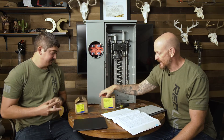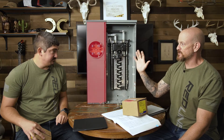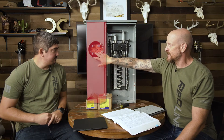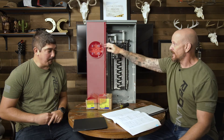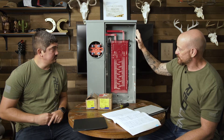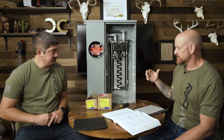This is like the most common electrical panel we install — it's a 200-amp all-in-one residential home line. Your utility comes in from this area. Once we install it, we're not really allowed to get in there afterwards. SRP or APS will put a lock on this — a little tab on there to tell people to stay out of their section, the meter section. Utility comes up, hits the meter, then the meter pulls power through the CTs — that's how they calculate your bill. From there it comes up through the bus bar into the main lug of your panel. This one's rated at 200 amps, with a 200-amp bus.